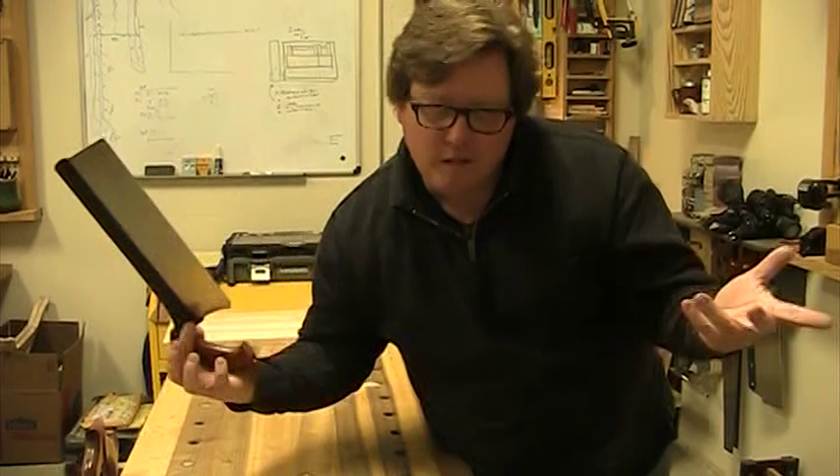I typically use two drills when screwing in screws. The first bit is as thick as the shank; the second is as thick as the inside diameter of the threads, not the full threads themselves — and in softwoods it's actually a little bit smaller so there's some compression. For those I use a little push drill like this, a Buck Rogers I believe from the 40s or 50s. You can actually be more accurate with a drill like this than with modern power drills — it all comes down to balance.